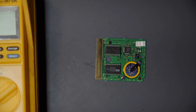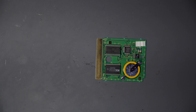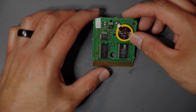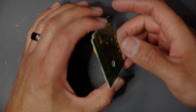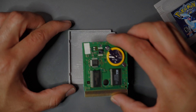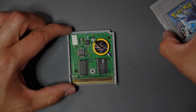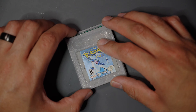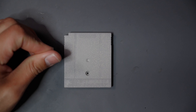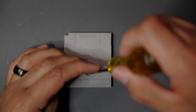The last thing I'll do — which I should have done first before I put that one on — was make sure it has a charge on it. My recommendation is definitely check the voltage if you're not getting your batteries from a reputable place, or if you're just getting them randomly online. Some of these will come out with no voltage on them, and that's a bummer because you spend all this time putting it in and then realize it doesn't work. Always check just to make sure — and we are good to go, we're at 3.3 volts here.